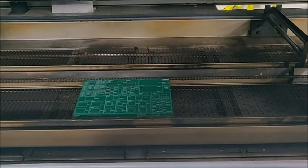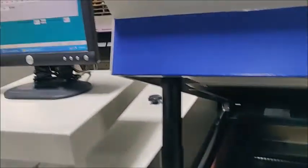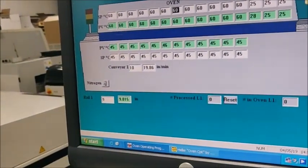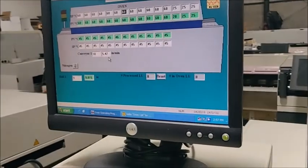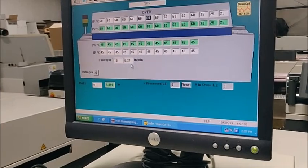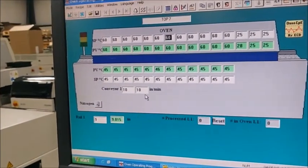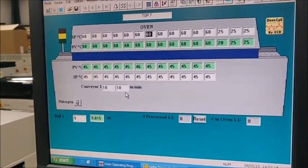Now it's at 20 — that's 20 inches per minute. It's really slowed down. Now we can slow it down to 10. I change it to 10, hit enter. Now you'll see it start to recalibrate itself down to 10. It's going to come under and then come back up. Will it go green when it's in control? Yes. There's probably some timer involved to make sure it's fully stabilized.